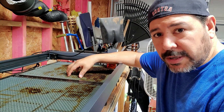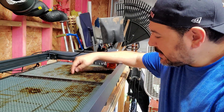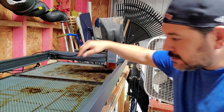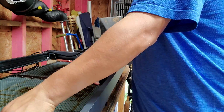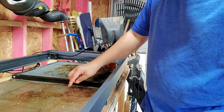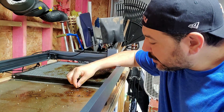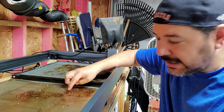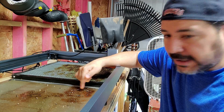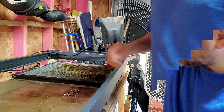When you're doing wood, the sap — the gooey stuff that comes from the wood being burned — kind of seeps down into these honeycomb wells and can actually drop to the bottom. You can still get flare-ups. Let me show you what it looks like underneath. This first panel looks pretty clear on top, but look at all this gunk — this sap down here. This stuff is flammable, and the little pieces at the bottom are still wood. When the laser goes down and you get enough accumulation of wood, you can keep burning those pieces and they can still cause flare-ups.